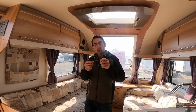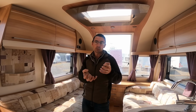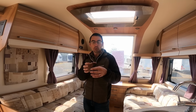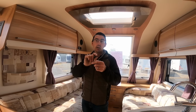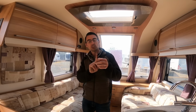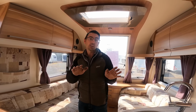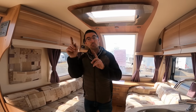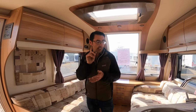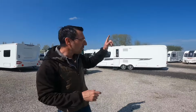So if you've got bad connections, sometimes because it's a wet area they sort of corrode up, and it's that plug that can cause the issue. It might be actually bad connections on the metal contacts, or it might be bad connections with the wires going into that plug, so that gets rid of all those issues. So good little video, and a good little way to just be able to replace that, so hopefully that will help somebody.